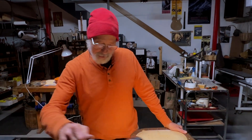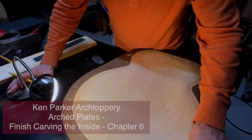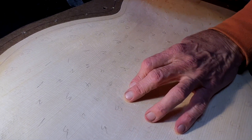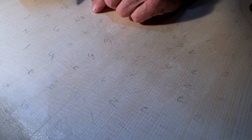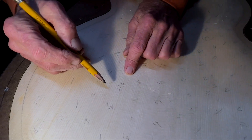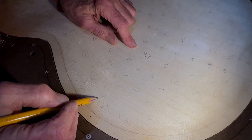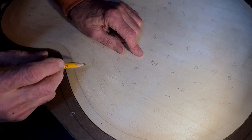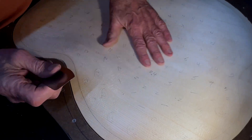Hi everyone, so back at this plate. I've been taking lumps and ridges out, and now what I've got is around 3.5 in the middle, a little less than 3 around the edges. My convention is — just to go over this — where it says 4, it really means 3.4, so all these single digit numbers have an implied 3 millimeters and a decimal point in front of them. And then around the edge, just because we're getting thin, when I write down a number that's under 3, I include the 2 and circle it just so I remember that this is a thin area while I'm doing my D bump and this part of the graduation.